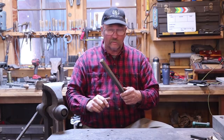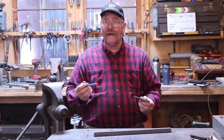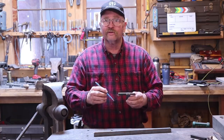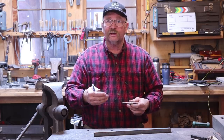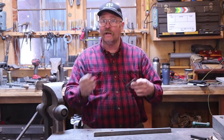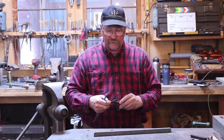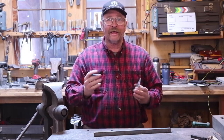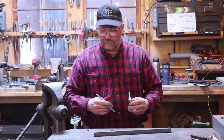This is one that pays to lay out where you're going to put the twist so that you get all of your cuts even. This involves chisel cutting, twisting, squaring the bar back up, chisel cutting again, and then untwisting it. Hopefully that'll all make sense when we actually get to doing it. The first thing I want to do is lay out the section for the twist so all my chisel cuts are the same length.